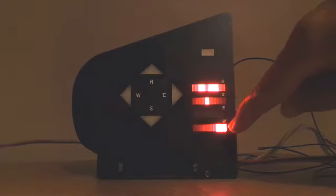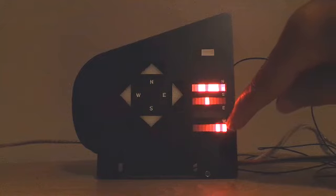Now what about the rest of the displays on here? This west bar gauge at the bottom indicates the state of the six ground switched inputs which drive the direction information to the module. So if I move the external sender around, you'll see that those values change. It's only the right hand six LEDs that operate, because they are the only ground switched inputs we have to the unit.